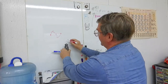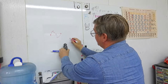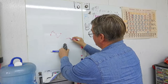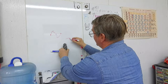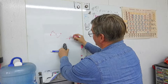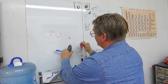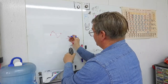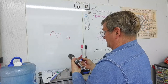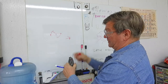There's a relief angle on the side of the drill. Ideally starting at the margin, the tip comes back into here. The dead center of the bit is drawn separately because it needs to be looked at differently from the rest of the bit - the reason being that the dead center of the bit doesn't actually cut.